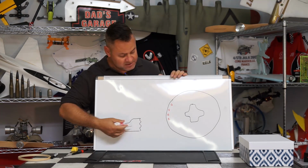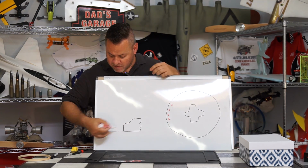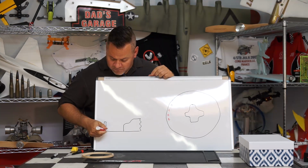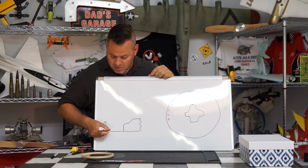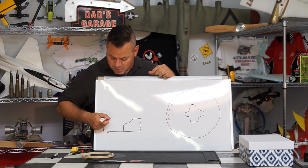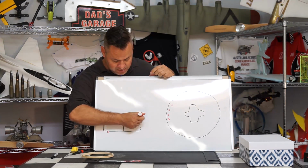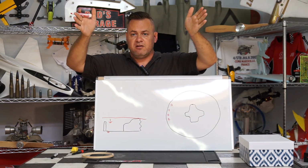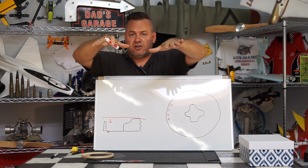Essentially, this is a side profile, or a cut right through here, and this is the outside of the hoop and our mold. So if the hole is here first and we've got larger and more holes to the outside, it's going to draw the plastic as it's laying up here on top. It's going to draw it down right here first, and so it's going to suck it in and then work its way towards the center.